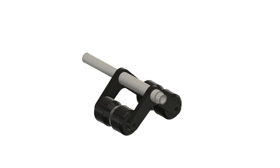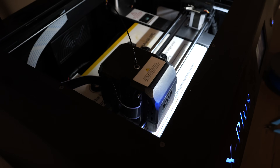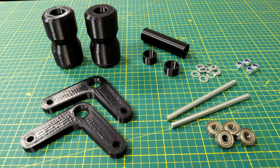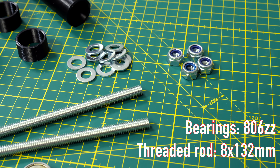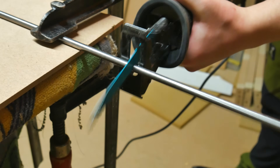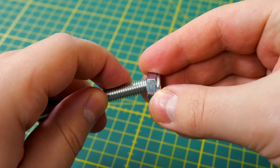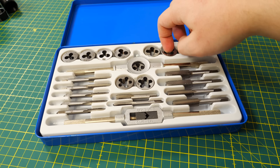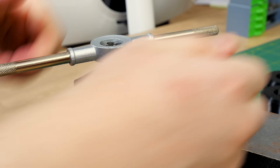The chain is ready — next I'm going to build the middle section. When this is ready I can assemble the whole thing. For this we need all the 3D printed parts, printed with ABS, though any other material works just fine. Then we need 4 bearings, 2 8mm threaded rods, 8mm lock nuts, and 8 8mm washers. By the way, if your threaded rod threads are damaged after cutting and the nut doesn't want to screw on, the best way to fix this is to take an 8mm die and turn it just a little bit — it should snap onto the already existing threads. After one to three turns the die should move completely freely and the threads are fixed.